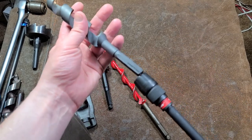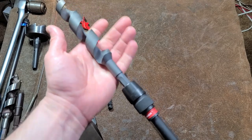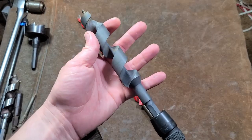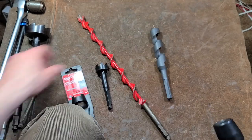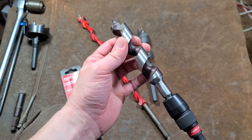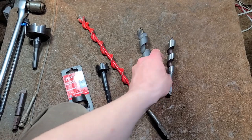The reason I really like this Milwaukee extension is because of how tight it fits. There's going to be more inconsistency in the shanks of 7/16 bits. This auger bit has very little wobble — it's actually more than acceptably tight. However, if we take this DeWalt auger bit, we get quite a bit of wobble, and that's just because DeWalt has undersized their shanks just a little bit.